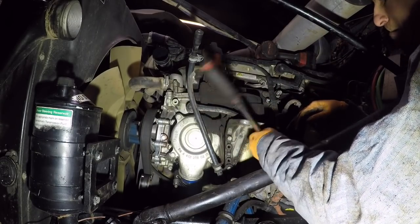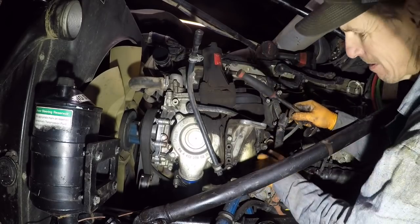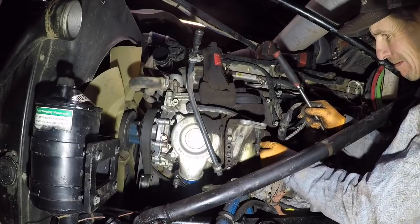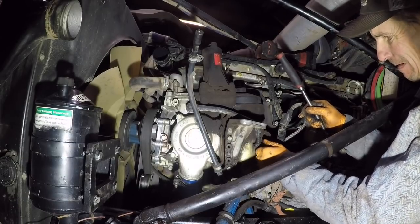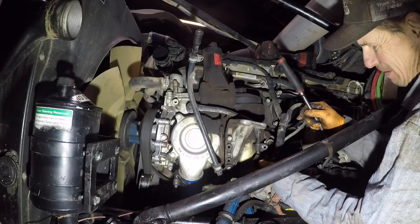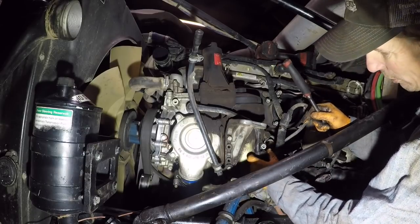I had to take the stinger, the positive on the welder, and switch it to the ground, and take the ground and put it on the work. Then I reversed polarity, and I went back over there, and it welded so nice after that.